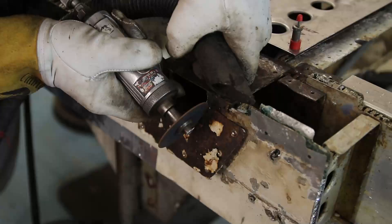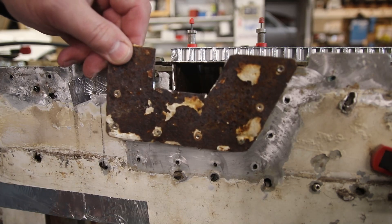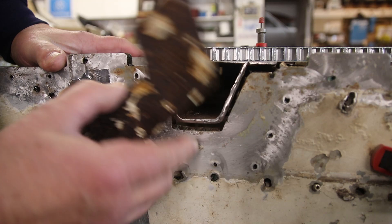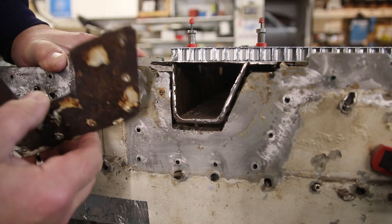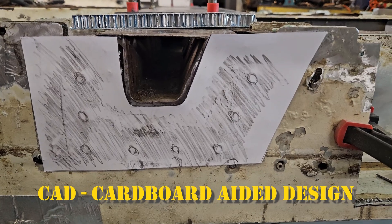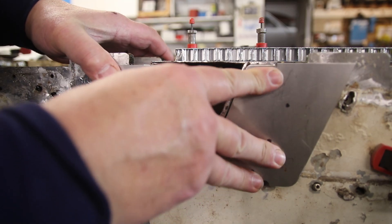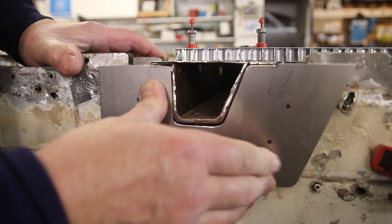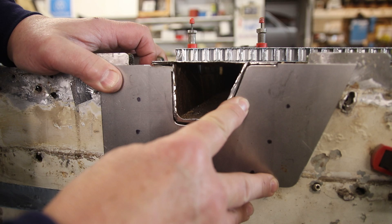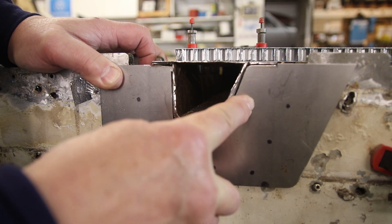I had the end cap off this end of the crossmember to get a look at the honeycomb underneath — the actual end cap is in very poor shape, it's rotten. It was stuck on with a spoonful of rivets that weren't really doing anything, reliant on glue that had since burst away, so the whole thing was floating free. I cut that out and made a new one which is quite a lot bigger. It'll weld in flush, we can put an angle over the top, get a host of fresh rivets in — the black marks show where old rivet holes are, no point hitting those again. It'll be glued and welded very carefully to avoid putting too much heat in, then lots of rivets. Stronger than ever.